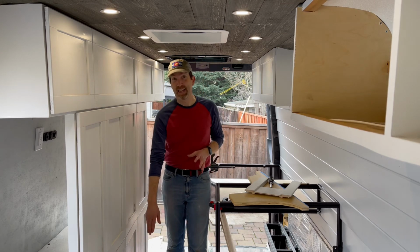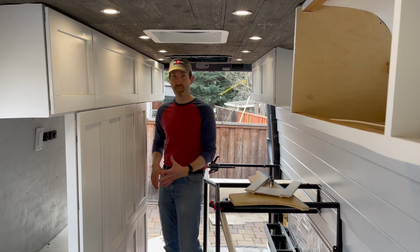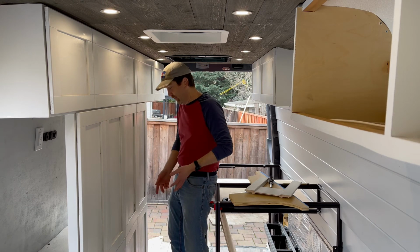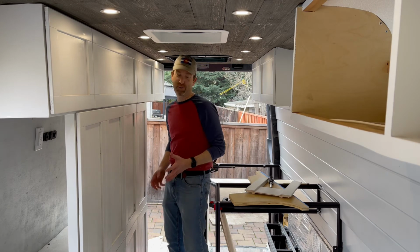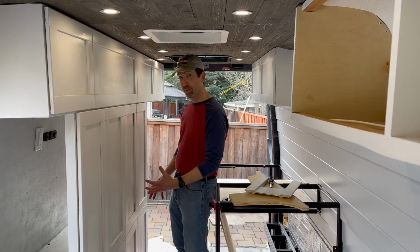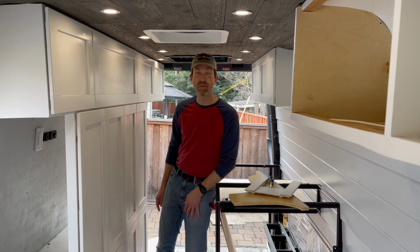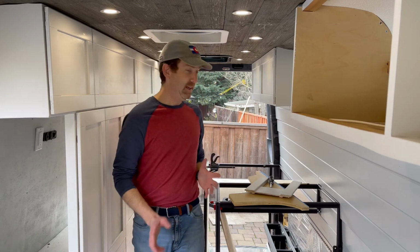The reason I think it got messed up is they're all built perfect, but this wood that it's connecting into bowed out a little bit at the bottom, and so when I connected the hinges in, it obviously is going to be farther apart. So I think that's what happened. And when I measured the door sizes, I only measured it up here. I don't think I measured between the 2 sections below because I assumed it was the same all the way down. So that is it.